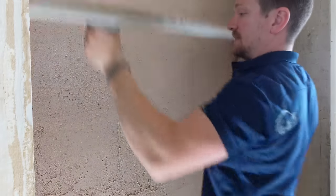I've got to emphasize this — don't play with it. Once you've applied it, take a few ripples out, but the next section we're going to really start getting the lime plaster flat. A lot of people are scared of using lime plaster — it's really not that bad. If you follow the process outlined in this, you can do it. It's just about timings. We're going to apply this coat and then leave it for another 20 minutes — we want this to take up and almost harden up a little bit. If you play with it too soon you'll just start tearing it.